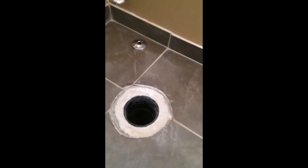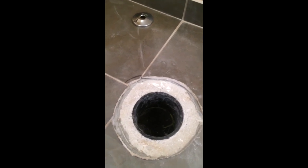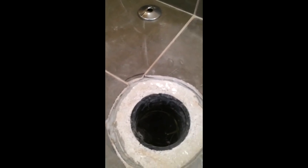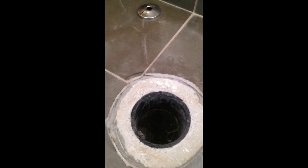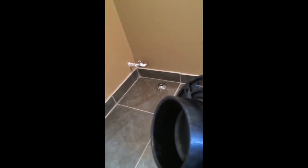And we see the drain for the toilet. This particular drain is 4 inch diameter and it's piped in ABS. This pipe runs down to a 4 by 3 elbow because for a tank type toilet, codes here state that you only need 3 inches for your drain. However, the way I pipe these is I like to use a 4 by 3 toilet flange.